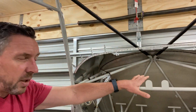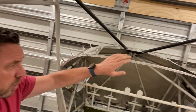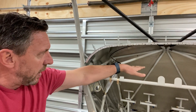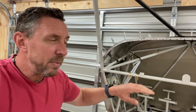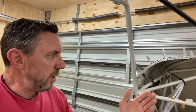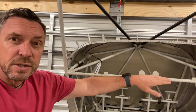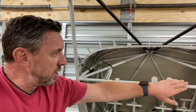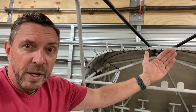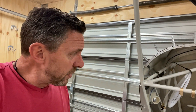This week I'm hoping to get the instrument order in and I've been giving a lot of thought to how that's going to mount up. Today I'm going to remove all of the boot cowl, strip it right back, and once I lower the aircraft down I'll have easy access. My plan is to build an avionics rack in the back there. The panel I've already got does hinge forward, and my rough plan is to install the throttle, mixture, pitch, and cowl flaps here, then have the panel made so it can fold over the top of them — it's going to be a little bit difficult.